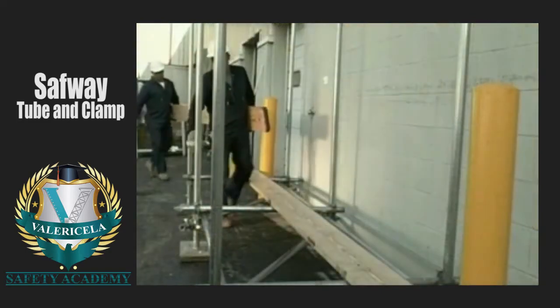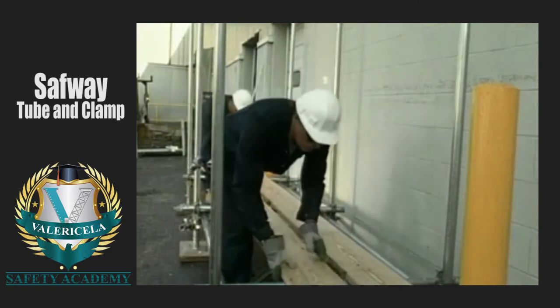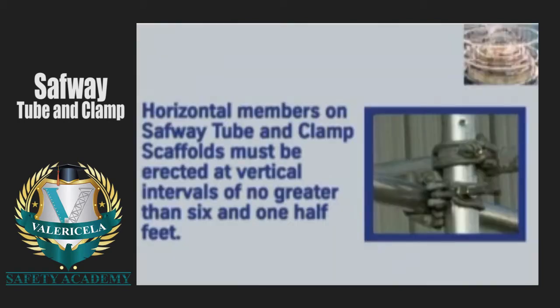Now you can install work planks on the first level to make erecting the second level easier. Use at least 2 scaffold planks. Horizontal members on Safway tube and clamp scaffolds must be erected at vertical intervals of no greater than 6 1/2 feet.